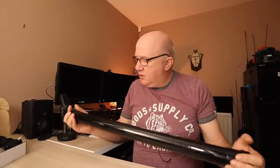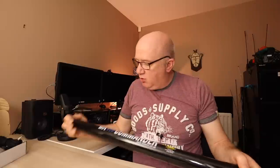Well, okay. Lucky for some then. So the DX Expedition pole responded very well to a 20 meter wire running 10 meters up to the top of the pole, and then down onto a fence, putting the pole at quite a bend. There was also a lot of crosswind, but the pole performed very well under those conditions. The only word of caution is when you're collapsing the pole, take your time with it, like any of these telescopic poles. Up to now, the performance of the actual hardware itself has been very good.